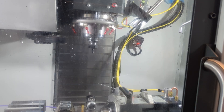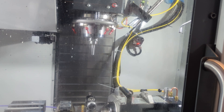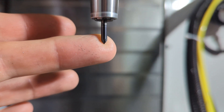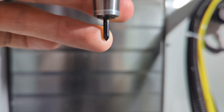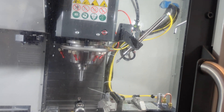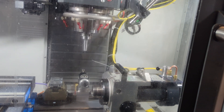Now let's check tool 12: MDI, T12, ATC forward. This tool should get drawn up right out of the octagon, and it should be the chamfer tool. I say should because we've got a standard library of tools posted on the Makerspace website. Standard means those tools should never change. If something else comes out of the octagon, please let me know. Then go ahead and measure it anyway — don't trust that it's been sitting in the octagon in a healthy status for who knows how long.